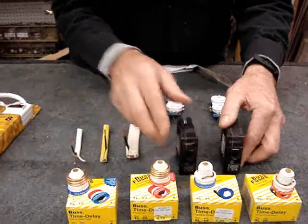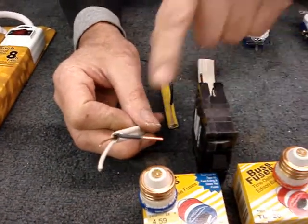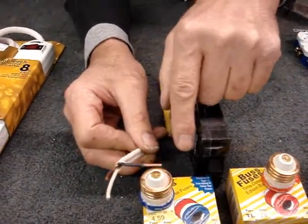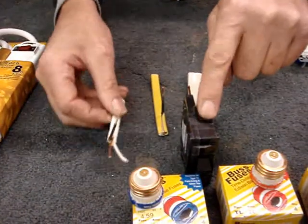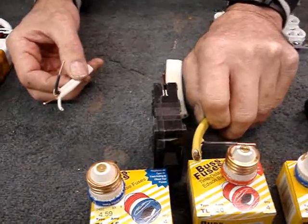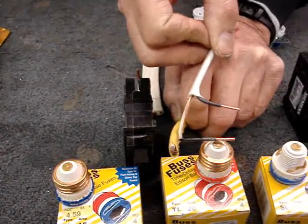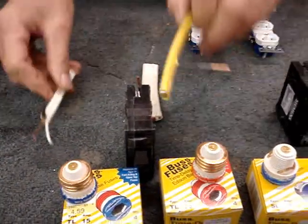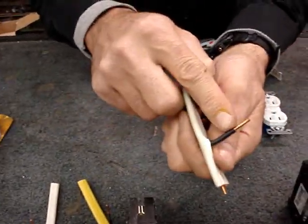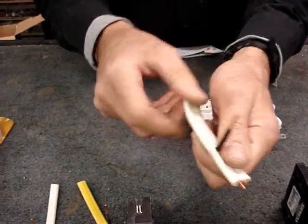To show you what goes along with these breakers: 15 amp breakers and 15 amp fuses will use 14 gauge wire. Here's a sample of the size of it, just to give you an idea of how big that diameter of the wire is. If you think you have bigger wire, here's a 20 amp wire, known as 12 gauge wire — a skosh bigger than the 14 gauge wire, capable of safely carrying 20 amps throughout the house. And just to confuse you a little, I threw in a 30 amp wire, which is called a 10 gauge wire. This is typically feeding your dryer, sometimes your air conditioner, stuff like that.